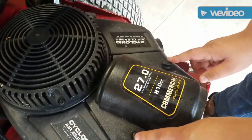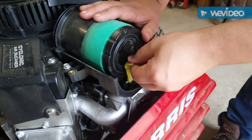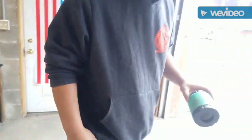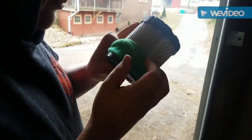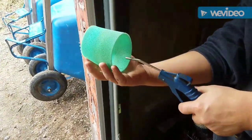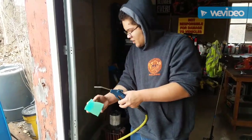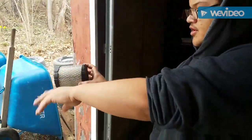These two screws are like butterfly nuts — you just screw them up and then the cover lifts off. This is your filter and there is a spring-loaded clip, you just ease it off. This is a cartridge filter, you just slide it right out. We have our air compressor here. I take this main filter off — this is the outer filter and there is an inside filter. I blow debris outside, getting my tip inside the filter and blowing everything out from the inside so I don't compact debris into the paper.